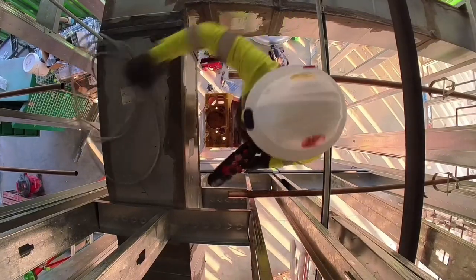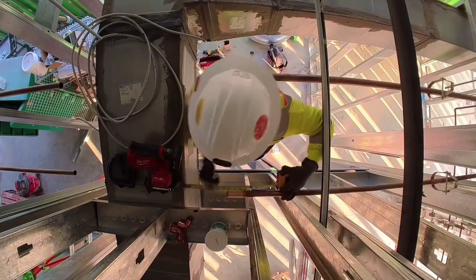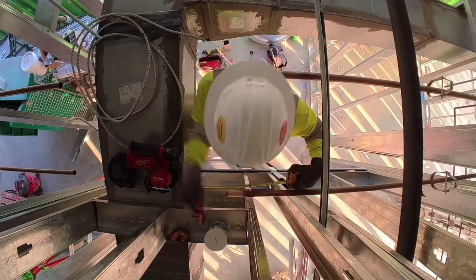And then this is where I'm working — I have to get 8 inches off of the HVAC guy's cement, so I have to be 8 inches above on either side: left, right, and up. So that's what I'm measuring right now.